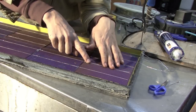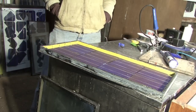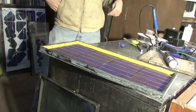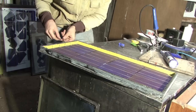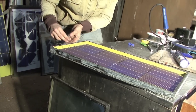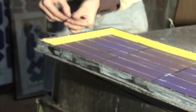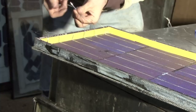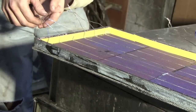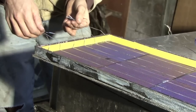I'm going to do that now, and then I'll explain how we're going to connect these two cells. We've now soldered the tabbing wire onto the top of the two cells that were lacking it. One of them is this one over here, and as you can see, these wires are now going to come off the top - that's going to be the negative terminal. These three are coming off the bottom here, so that's going to be the positive terminal. So we've got the positive and the negative output.